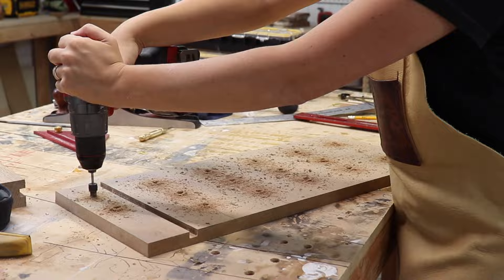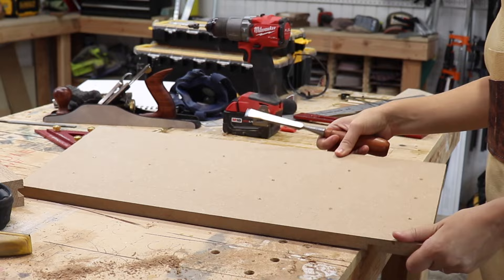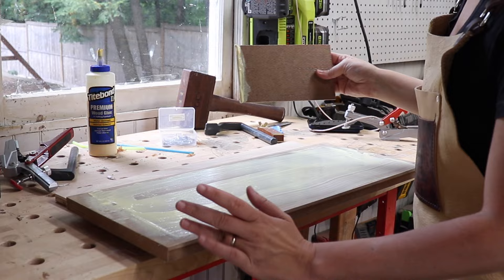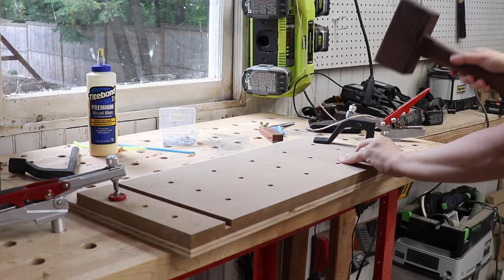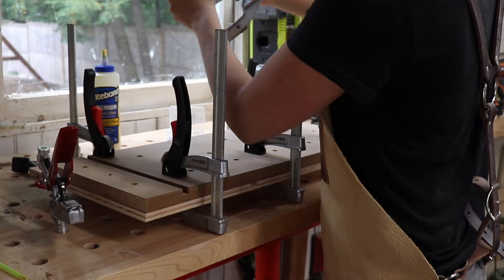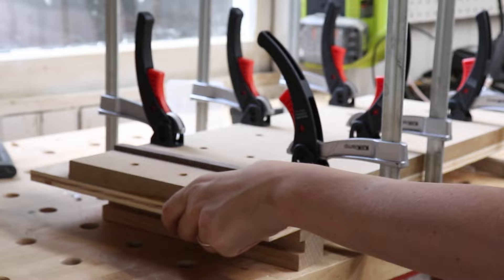Instead of using clamps to hold the two pieces together, I decided to use screws while the glue dried. I pre-drilled all the holes, and since the wood sometimes lifts up when you drill, I used a chisel to clean up around those holes so the board would be perfectly flat — especially important on the back. I put on glue, being careful not to get it near the edges to avoid squeeze-out, then temporarily clamped it and locked everything down with screws. Finally I put glue into the dado and banged the walnut fence into place.